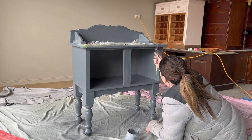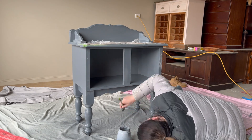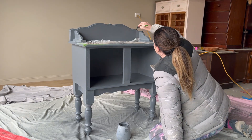There are a few areas that are really hard to reach with your spray gun, especially up underneath the piece. That's why it's really great to go over and apply a nice solid first coat over the entire piece and make sure you get any spots that you may have missed with your spray gun.